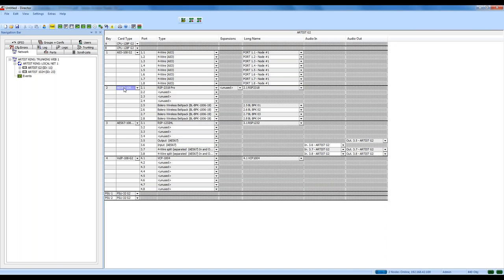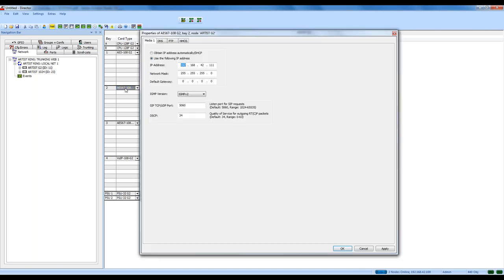Again, if we picture the scenario of an intercom panel, a matrix, and a wire connecting them, we're talking in this case about a matrix card, a piece of hardware that's going to host the antenna device as opposed to the old-fashioned panel, and it's going to route and process the audio. Now, in AES67 form, we basically have to reference these devices to one another. As these are IP devices, Ethernet devices, instead of connecting a cable to a panel in baseband form and letting it do its thing, we have to configure these cards. Every card is going to have an IPv4 address, netmask, and gateway. This is all routable. It's no different than any other Ethernet product. You're basically just telling the network, I'm a device, this is my address. We're using this address and this personality to route and associate to it across the network.